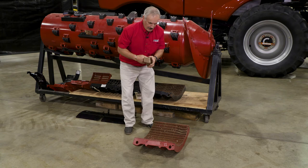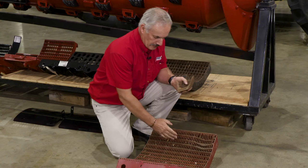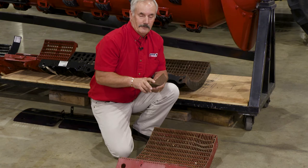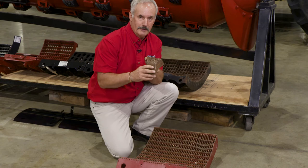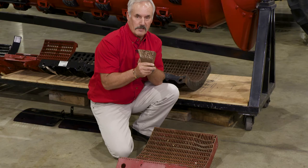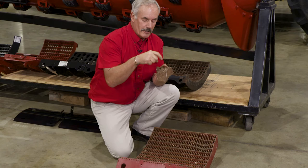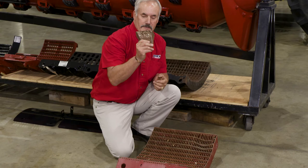So what's the concept behind these bars? A lot of people answer that they're there for threshing — but in reality, they're not there for threshing. They are interrupters. Similarly, the rasp bars on the rotor: people say they're for threshing, and if they're worn out, you get less threshing. But we do sell smooth rasp bars — those are used for popcorn. These bars inside the combine keep the crop moving through. The crop comes in, gets interrupted, and continues through.